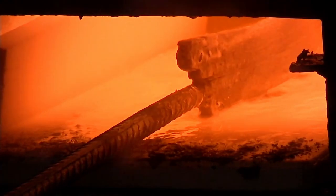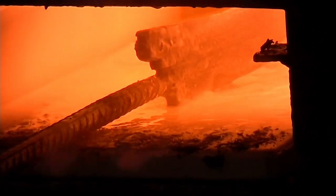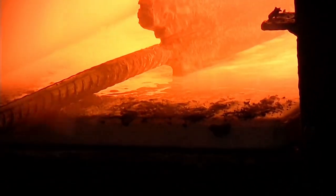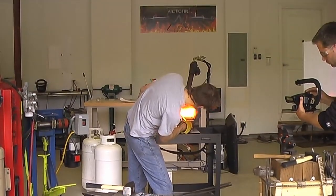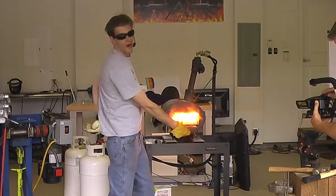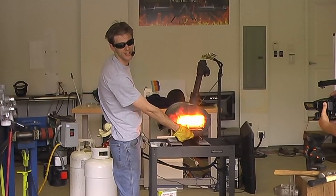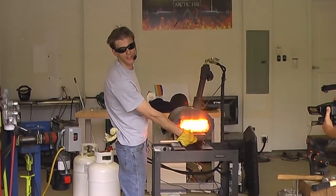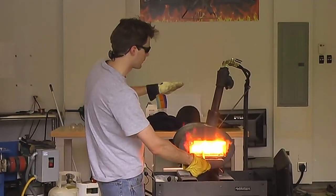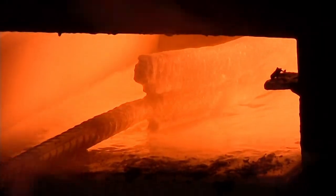Now, due to the length of the forge, I'm pretty sure that maybe 7/8 of the blade at the tip of the billet is now welded, but there's still an area all the way at the back that isn't. That's just because I couldn't get a full heat over the entire length. So you've got to work it in sections. When you're working on a sword-size piece, there's no way to do everything in one heat. So you've got to take it in sections and overlap your weld. You're starting from a welded point in the blade and working your way back towards the handle.